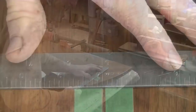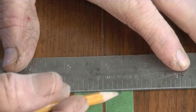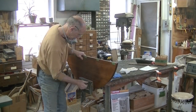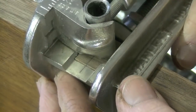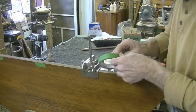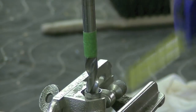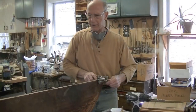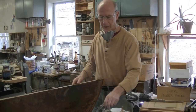Now I lay a straight edge perpendicular to the joint. I'm going to drill for the dowels. I'm going to use this doweling jig to line this up. Now I only want to drill one inch, so I'll mark my drill bit. And now I'll just do the other board that's getting glued on here and I'll do the other table half.